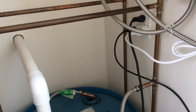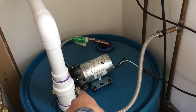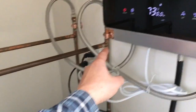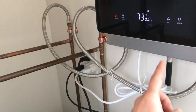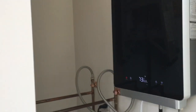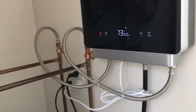This is all the plumbing here. The water comes in, gets pressurized by that pump, goes into the cold line, up through here and through this hose right here, and comes into this unit. This unit is an EcoTemp - I believe it's an I-12 LP, so liquid propane. As you can see, it's vented directly outside of the container and it's on.